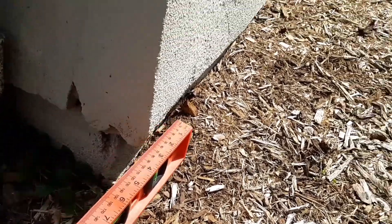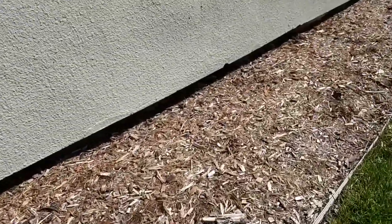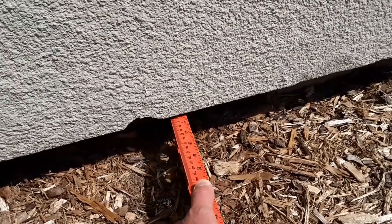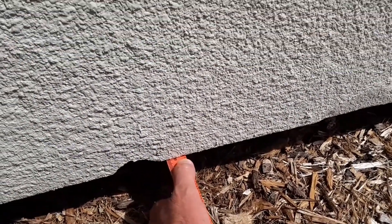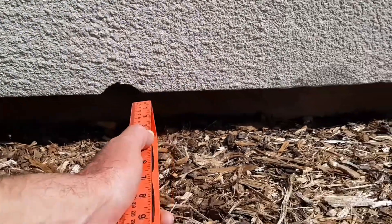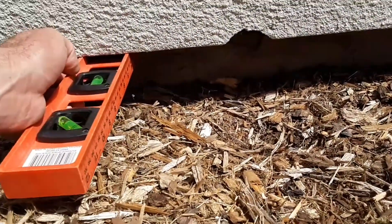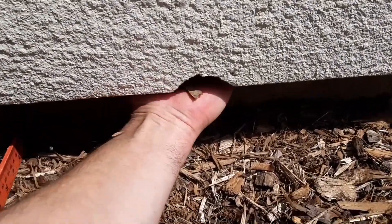Let's go down this wall area here and I'm going to show you the bowing on the underside. As I take my level and measuring device and put it all the way in, you'll see that it's now at probably about three and a half inches. The sill plate I noticed wasn't even touching underneath here on that foundation — I can get my hand underneath this area and I'm feeling the cool air from the basement right here.